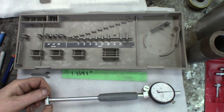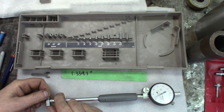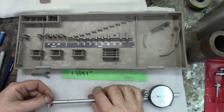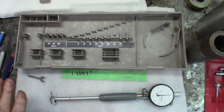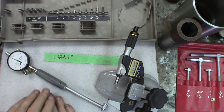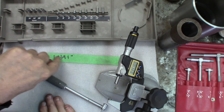We're going to be adding the washer plus the pin at the other end. This is the push button there — you see that pushing it — but this is the fix button here. Fix them. Just lightly tight. That's good enough. Don't over-tighten this because you're going to have problems. Now we need to calibrate this dial bore gauge to read this measurement.